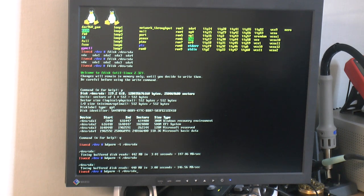It can also be the control card just can't go past that on the port, or it could simply be that the chipset on the motherboard just doesn't allow for much more in this particular use case. But that's more than you would get from a SIL card, any SATA card on an ordinary 32-bit PCI slot, assuming 33 megahertz. Technically 66 exists, and a lot of controller cards can do that on 32 bits half-length PCI, but most motherboards rarely have 66 megahertz support, so this is already faster than an ordinary PCI slot, so that's an improvement. So yeah, that for Windows 2000 or even XP would be really fast anyway.